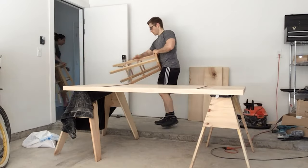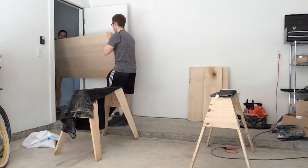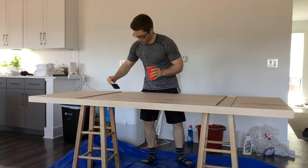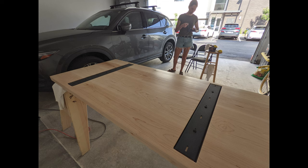It's not done, but I don't know if I can take it anymore. It looks pretty good though — it's nice and flat. I'm worried that when I seal it, it's going to be inconsistent: part will be nice and flat and shiny, and part will be pretty flat but scratchy. But this is the underside of the table and we've been working on it for months, so it might be good enough. We decided it was indeed good enough and moved the table back inside to restart the finishing process. There had been a lot of sanding to remove those coats of water-based polyurethane. It turned out to be really important to finish inside because of temperature and humidity. After installing the C-channels, we flipped it and continued.